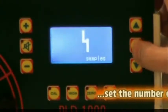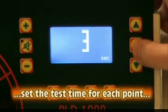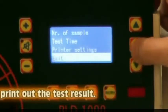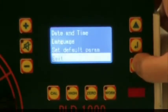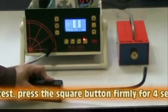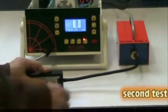Set the number of samples desired by selecting Number of Samples. Adjust by pressing the arrow keys. When finished, press Enter. To begin the test, press the square key on the probe or on the display. Hold for four seconds — the length of time to hold the key is adjustable. An audio alarm will beep to signal the operator to move on to the next sample.